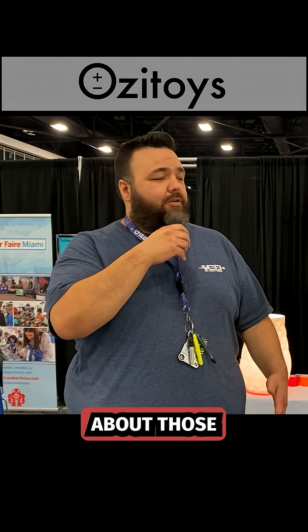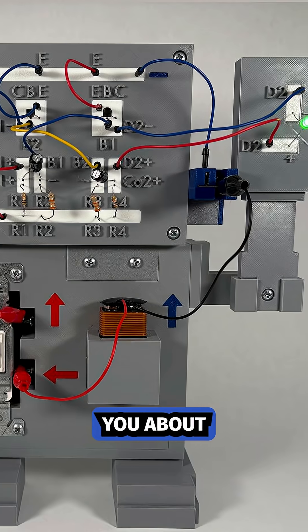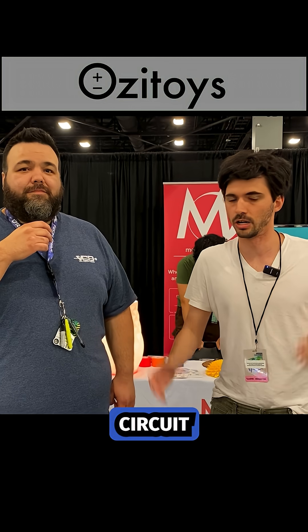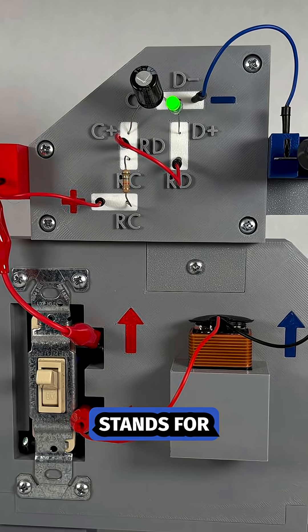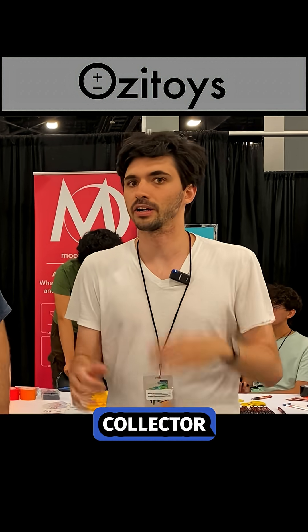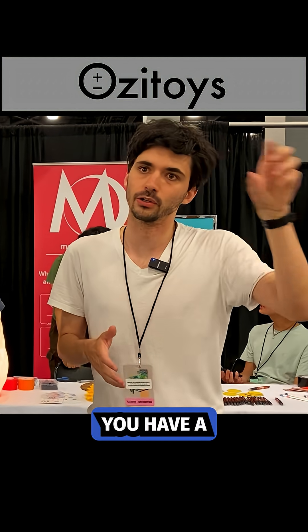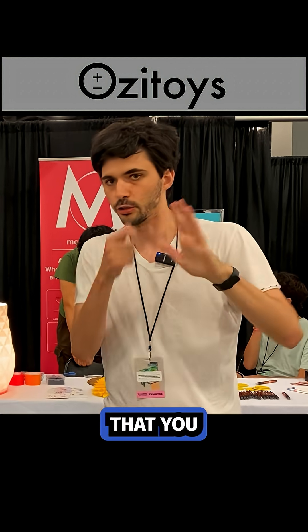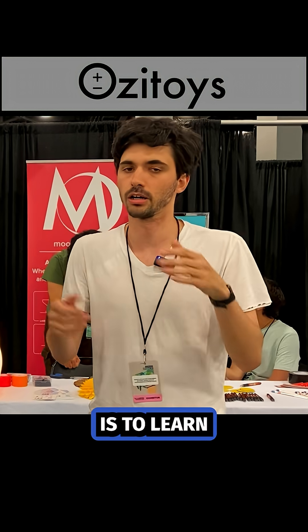Could you tell us a little bit more about those Ozzy Toys? They're educational electronic toys that teach you about hardware discrete components. Each toy teaches you how to build a specific circuit. On the face of the toy is a diagram with letters and numbers — for example, R which stands for a resistor, C which depending on context could stand for the collector of a transistor or a capacitor. If dealing with a polarized capacitor, you'll have a C-plus and a C-negative. There's a construction video you access via a QR code that comes with each respective toy. The idea is to learn by doing and having a kinesthetic, tactile experience.